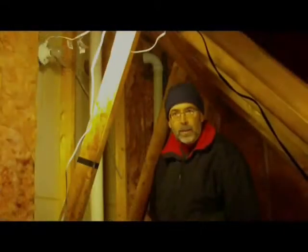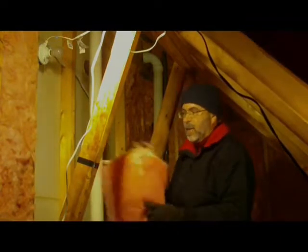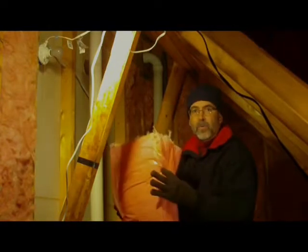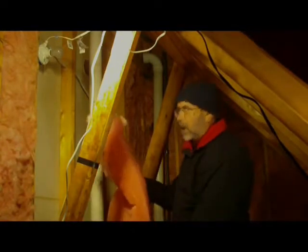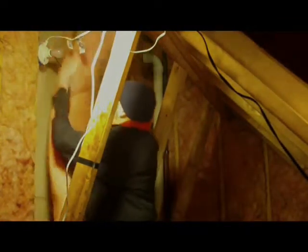There you go, it's cut. Since I know I'm replacing three panels, I'll go ahead and make all three cuts and put them up at the same time. When cutting several pieces, make your first cut, then lay the next piece over and use the bottom one as a template so all cuts are the same. By the way, I really like this kind of insulation — it's covered on both sides, so there's nothing to stir up.